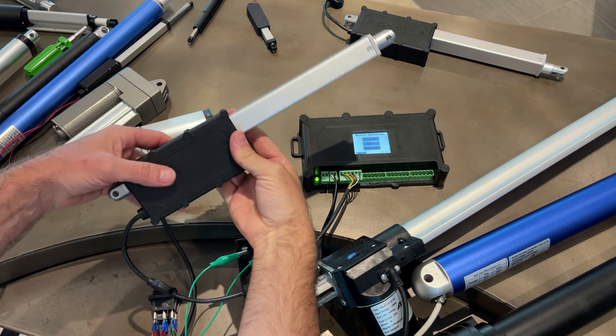At higher voltage, like 20 volts, it's fast - and also very noisy. Let me put it at 10 volts and show you what happens to the current draw. On the low setting you can see that when running it pulls about 0.2 amps. If we apply force to it, that goes up - the more resistance you put on the motor, the more power is required. If you stall it, it would eventually burn out the motor. On the high setting you can see the maximum current draw at stall goes up to three amps maximum.